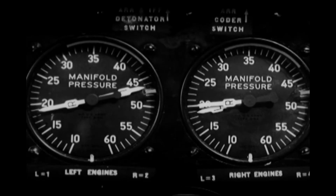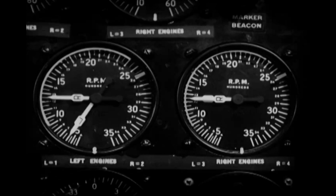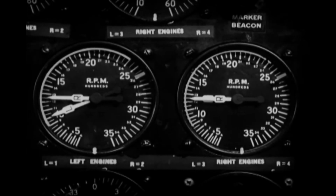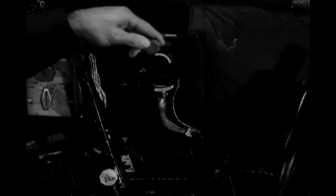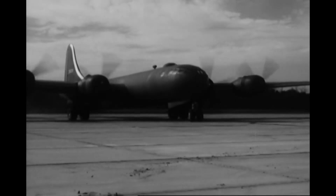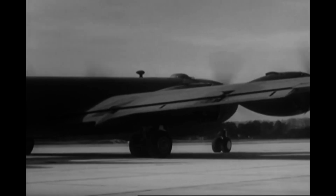The turbo's okay. Bring the throttle back to idling, around 550 to 600 RPM, and increase speed to 1,200 to avoid fouling the spark plugs. Next, start on the number 2 engine. This same procedure is repeated for each engine. Now you're about set to take off. After you're cleared for takeoff, turn the plane the rest of the way around so that it points down the runway.